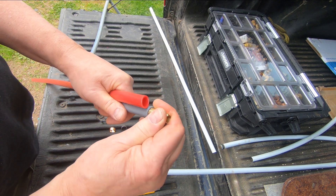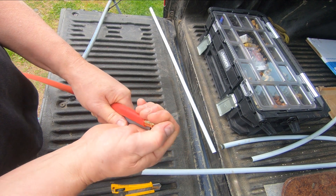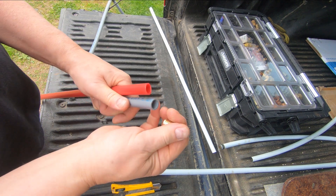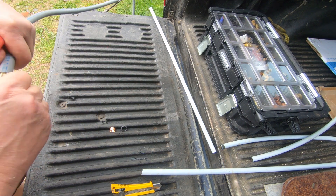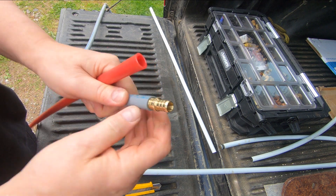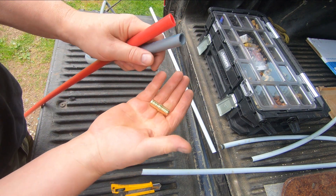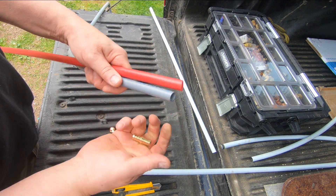See here — there's the poly B, and that's a snug fit into the poly B; it has to be pushed in. That will not fit inside the PEX — it could not go inside the PEX — but it will go down inside the poly B. Therein lies the difference. If you encounter poly B pipe, you can't just join it with PEX fittings.